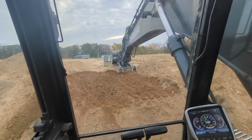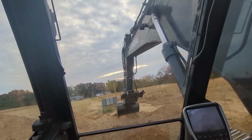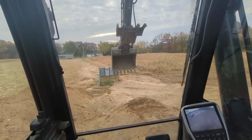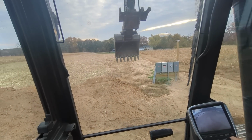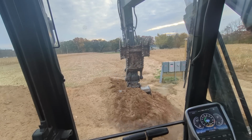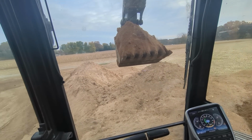So that's in. Sump pump pits are in. Just to recap a little bit, I ended up putting 2 sump pump pits in just so I have options for utility sinks or wash tubs, whatever you want to call them down there, laundry tubs. I can drain them into those and pump it out. Or I could have put an ejector pit in if I wanted to put a toilet down there, but I don't ever see putting a toilet in the basement. So anyways, we're going to start this backfill.